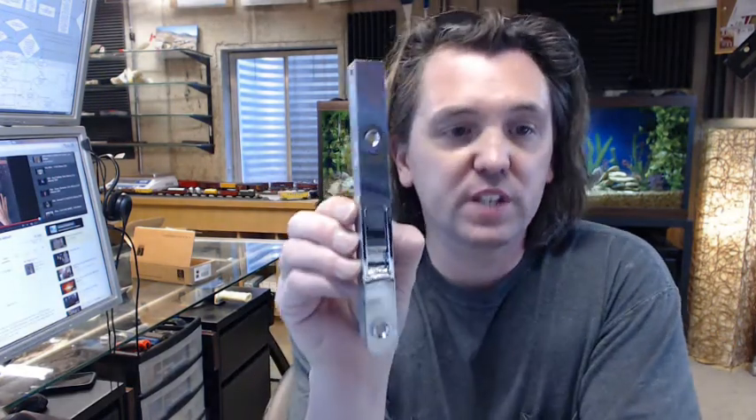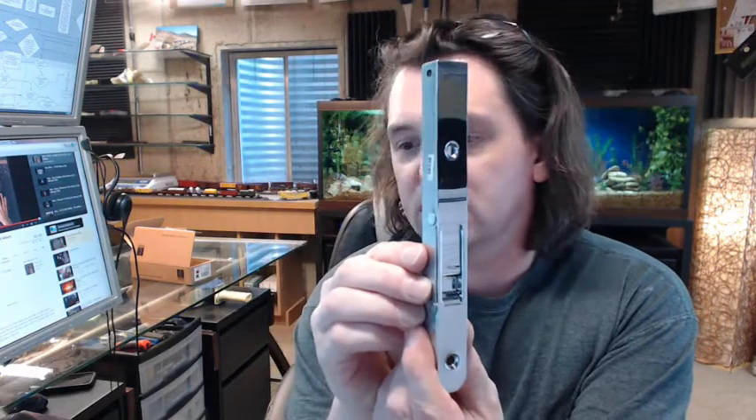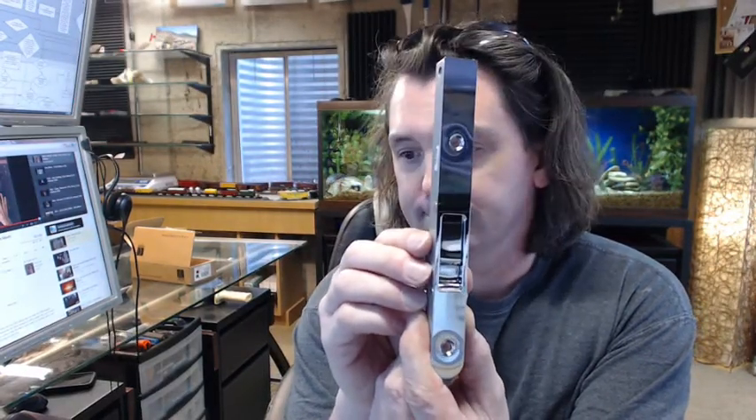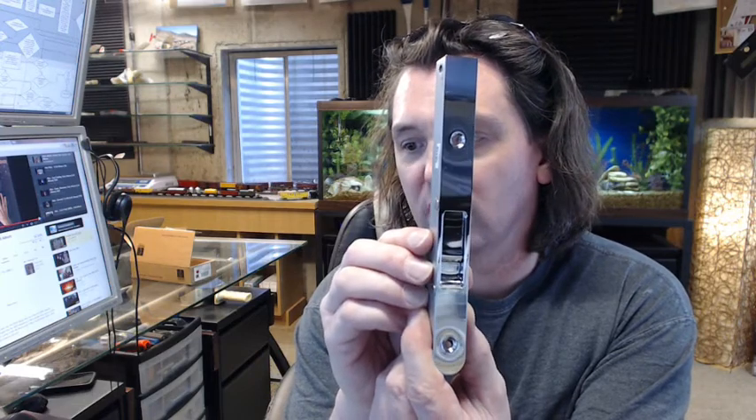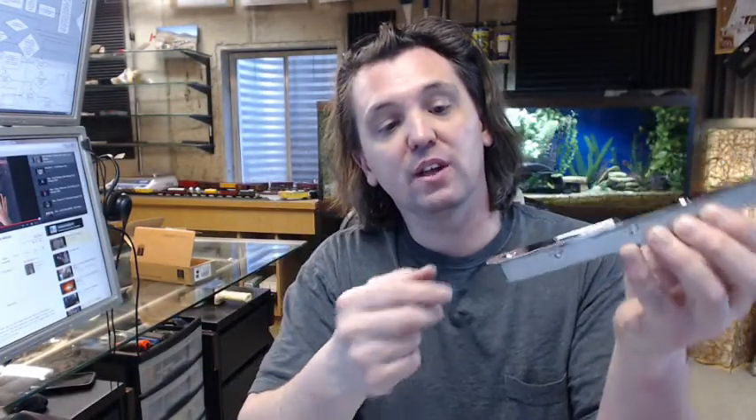Hello, my name is Rich Howard, owner of Architectural Builder Supply. This video is to bring you a closer look at the Hager No. 1416 flush bolt — they call it a single route flush bolt. That is a reference to the fact that the preparation for this flush bolt requires nothing other than a single type of pass with a router, just one preparation to give you the entire installation of this item.